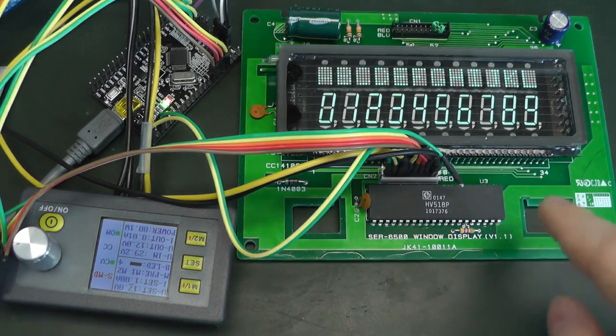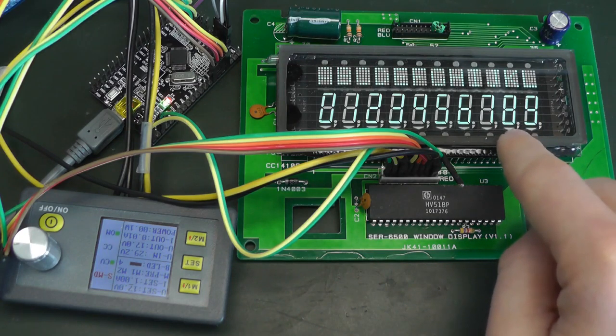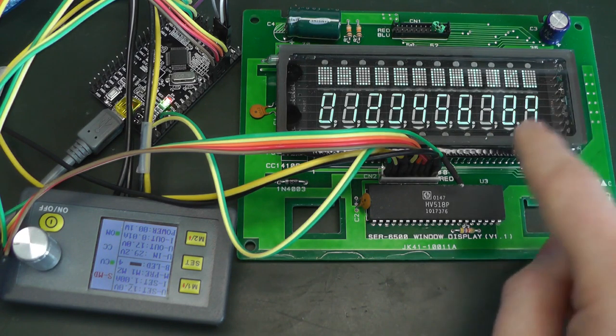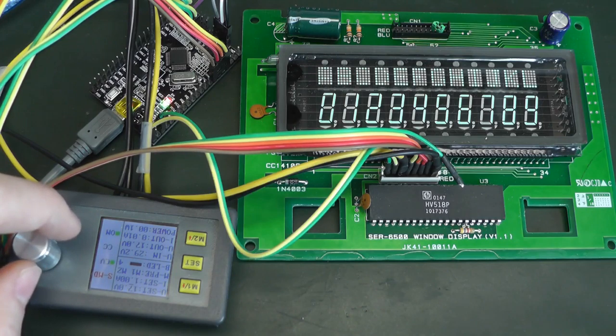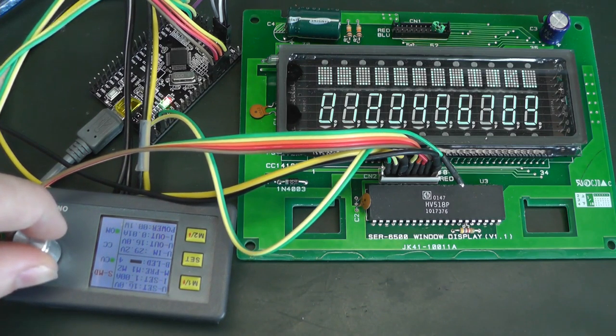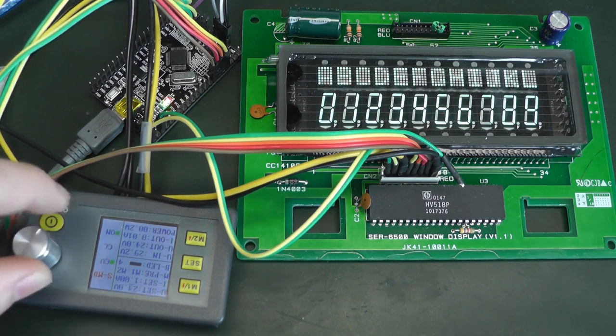And actually, probably you cannot see, but there is actually something. But it's very, very dim. And I've set it to the same voltage as the demo we had before, where we went to the segments individually. We're at 17 volts. And if I increase the voltage, no, that's decreasing. If I increase the voltage, you see the text begins to appear.